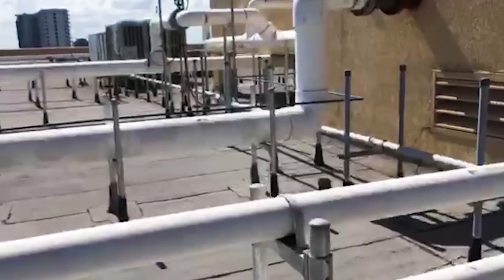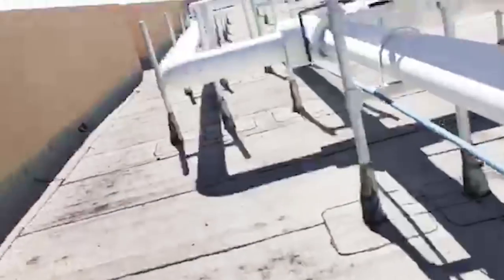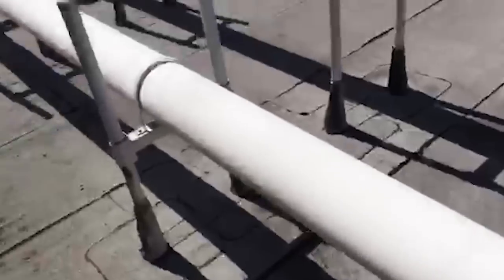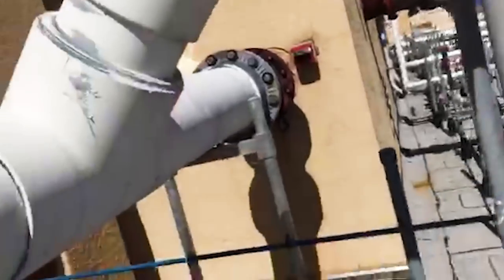This building has condenser water and the loop is completely open. Up there you've got a tower bypass valve. There's our discharge water coming out, and this is our return side going back to the tower. This is our tower bypass valve, which is going to let the water go right back to the pumps instead of through the tower. There's the inlet side of the tower and the outlet side, just like we saw in the previous video. You've got your makeup water — the float assembly is going to be in there.